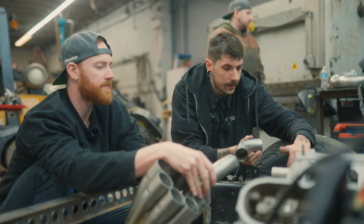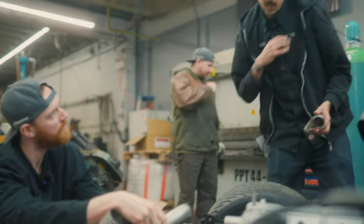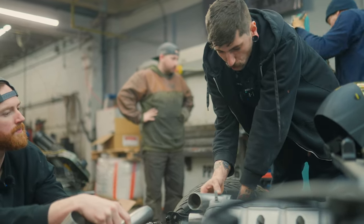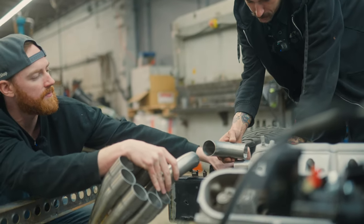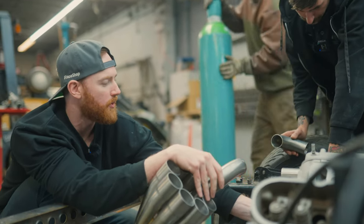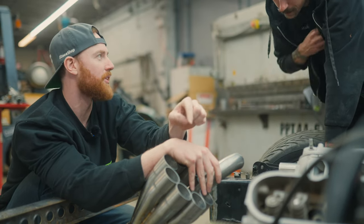I'm thinking we pick chassis points so that when you look at it, the welds are going to be in the same spot. So up here is going to be way too close to the motor. That's on the end of that chassis point, like right at the edge there, or the inner edge there. Let's trim that one. Put the marker right against this motor plate on this side and just mark the tube, and then we'll do the same thing over there.